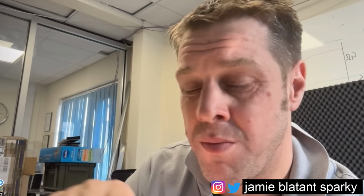You can get dirt and grit in motors, grease, water, all throwing your readings off and getting really weird readings. Your readings might not be stable. They might be fluctuating all over the place, in which case you've probably got water. But yeah, let's now do the insulation resistance test of the windings.